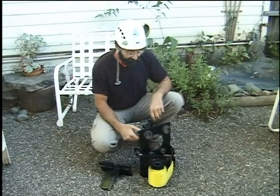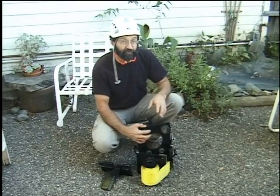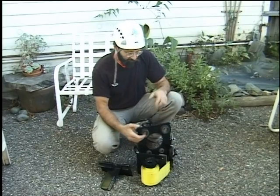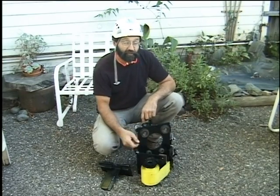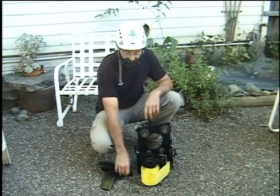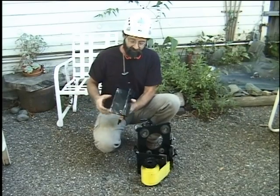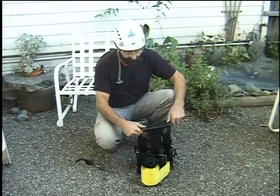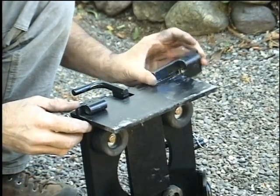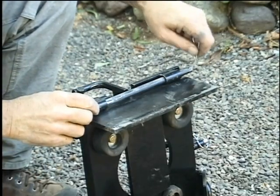The frame for the GRCS has rubber feet on the back that let you use it on preservation jobs, and they give pretty good traction on removal trees. But sometimes when you're bouncing big wood into it or really cranking something up, it starts to tear up those rubber pads and the device can move a little bit. To get around that problem and make the device more stable on the tree during removals, we created this accessory called the visor. It takes just a few seconds to snap it on — it'll fit every GRCS frame out there. Lock it into place with the same pin we use for locking the winch in.